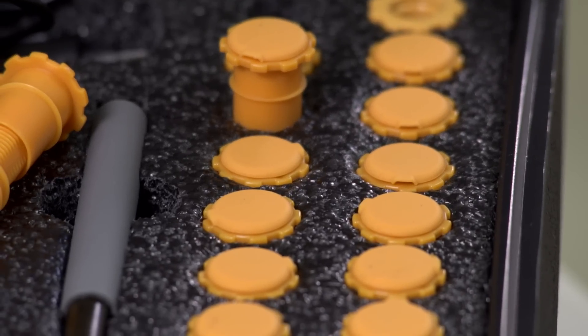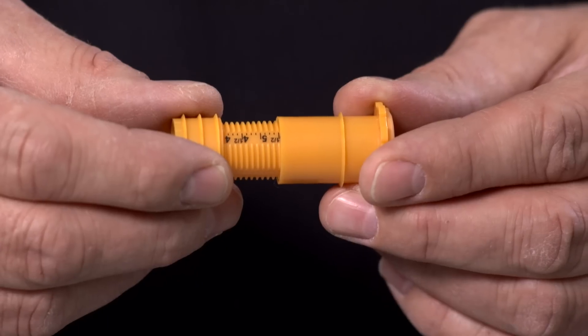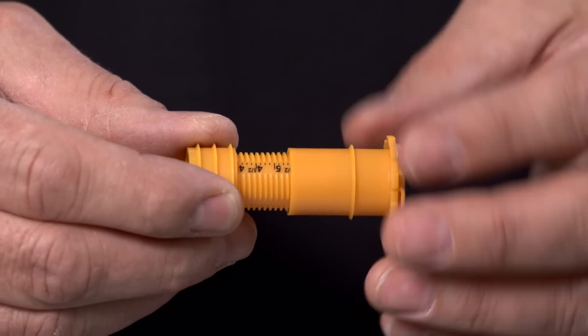The kit also comes with 20 humidity sleeves. These sleeves are fully adjustable, so you can adjust them to the depth of the slab. Today, we'll be outlining methods and demonstrating the F2170-11 standard. This standard is a North American standard, but it is being widely adopted globally. Please check your national standard before using this kit.